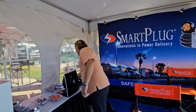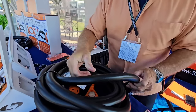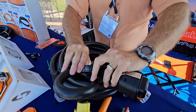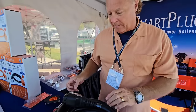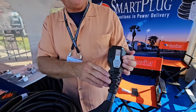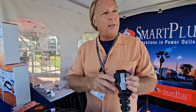Smart Plug also offers manufactured cables if you want the best in the industry. Their super flex cable is the most flexible cable available and maintains that flexibility even at freezing temperatures — very easy to handle in a tight basement compartment. It's an over-molded unit, making it extremely watertight. But if you have a good existing cord set, you can simply snip off the twist-lock end and splice on a Smart Plug unit.